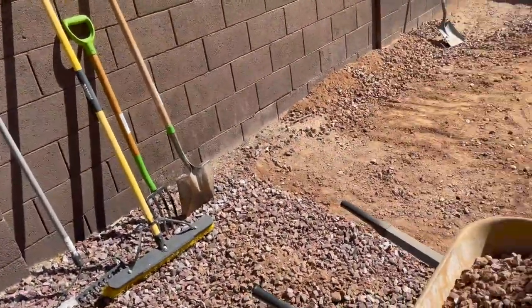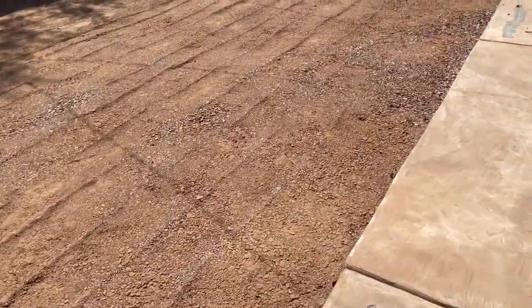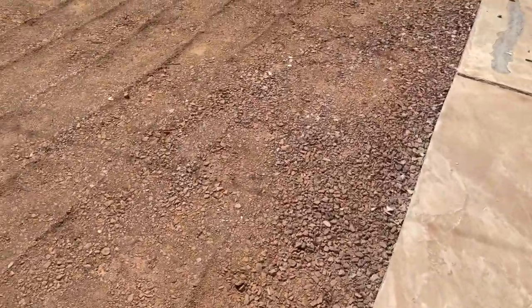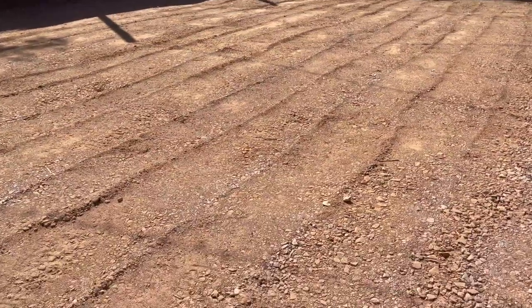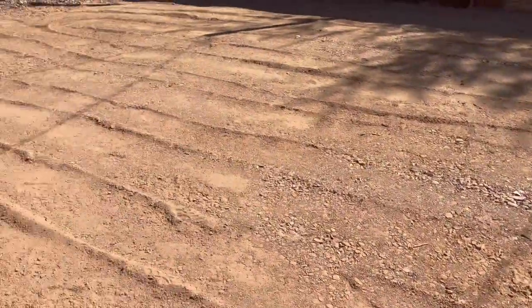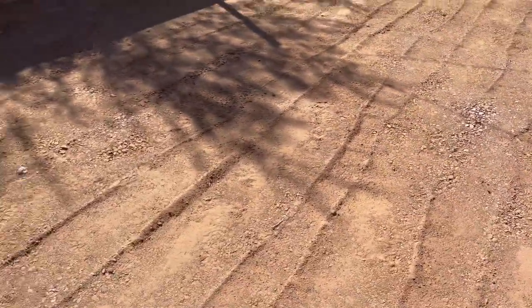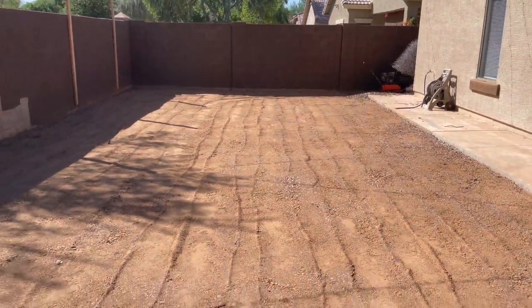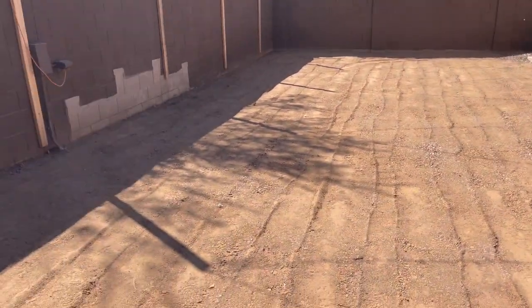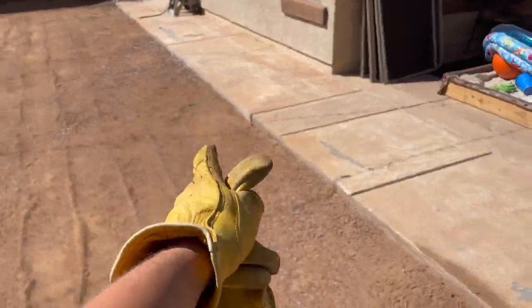There's no way to get a trailer in here. There are water pipes, a cable box — all that stuff in the front yard. So I don't want to wheel in decomposed granite or quarter-minus fill back here; I thought I'd try the tamper instead. You can see the waves in the yard now because it was never flattened properly — with rock you can fill it unevenly. Now I'm taking a landscape rake to get it as flat as I can, moving dirt over to fill in where the rock was.